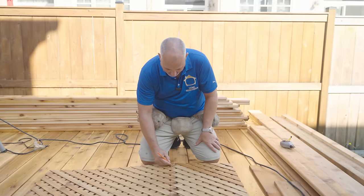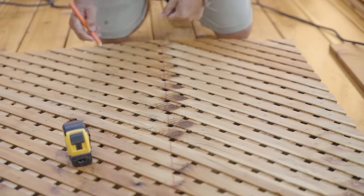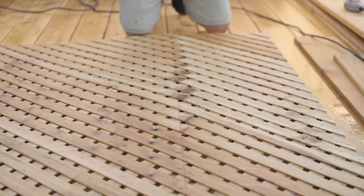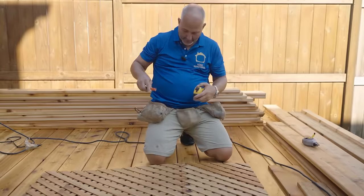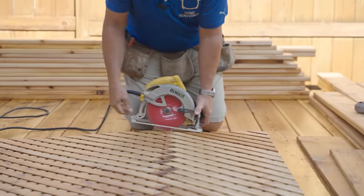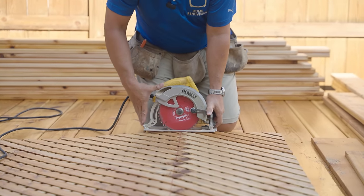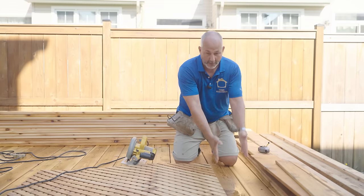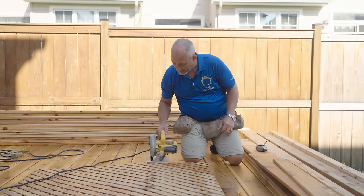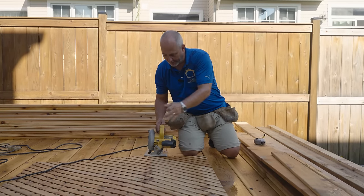In advance of cutting, here's what I'm going to do: I'm going to cut straight here to about this point, so I'll be short, and then go a little bit long here, then pick up the chalk line around there. Good to have a plan — know the end from the beginning, and then something like this is quite easy. We put the blade on the wood. I'm going to walk along on my knees basically and reach over and do the cutting, but I'm going to avoid the staples, finish through, jump cut. Let's get this done.